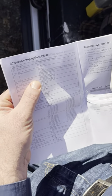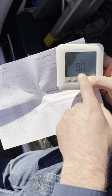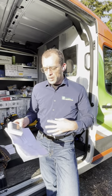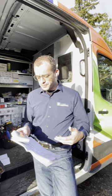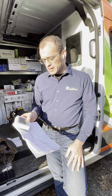Menu 430 is minimum cool set point — if you don't want the thermostat set lower than, say, 70 degrees, you can set that limit here. Menu 431 is the maximum heat set point. I rarely find this important unless it's a rental or commercial space where people constantly mess with the thermostat and the system can never catch up. In those cases the building owner might choose to limit the set point range or lock the thermostat entirely.